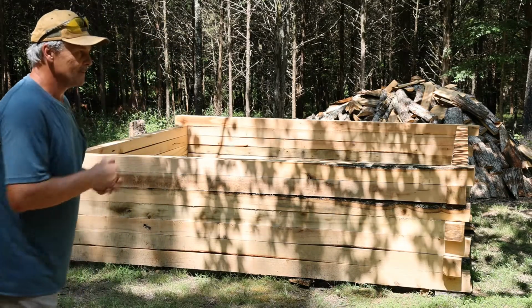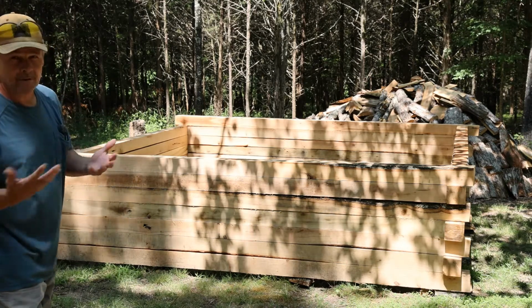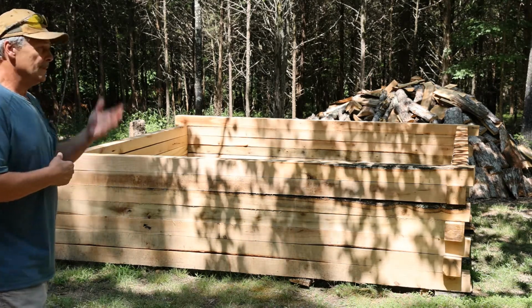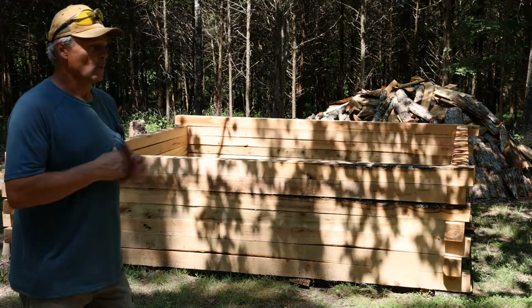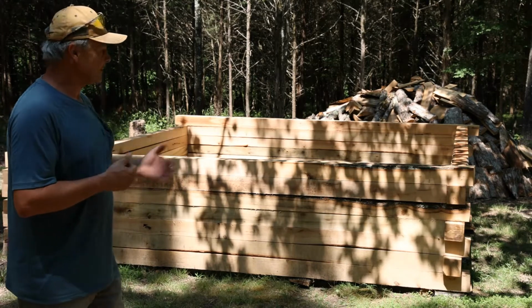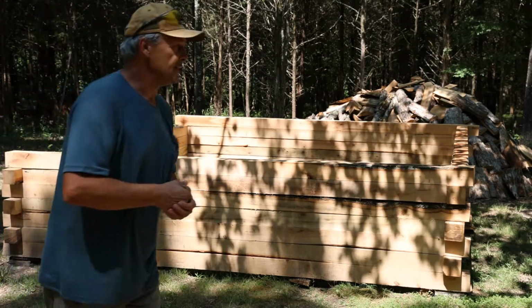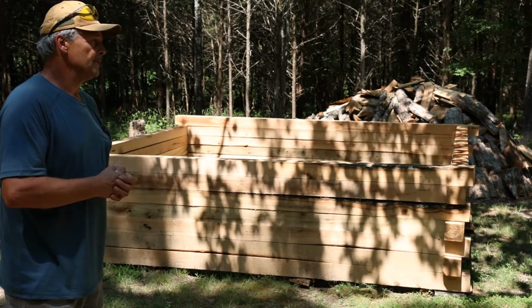And I will say the little HM126 is doing a fantastic job of cutting this stuff square and flat for us. And having a 7-inch taper on the log that we started with this morning and wasting very little of that tree and turning it into 4 5x5s for this build is a plus. And we actually ended up with some nice 1-bys off of it too.